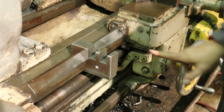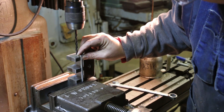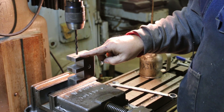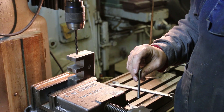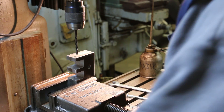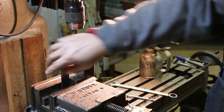I'm happy with the clamp. Now we need to make the pin to go through here and drill and put in our pivots for our swing-down arms. We're going to use a quarter-inch bolt for that — I've got a long one that should give us a good bearing surface. We're going to punch a quarter-inch hole through the top piece and the second piece, then switch over to a number seven drill bit, and that'll be tapped quarter-20 for this to screw down into. I've come in a half inch from the edge and a half inch from the bottom. I put a square in there to make sure we're drilling perfectly perpendicular.